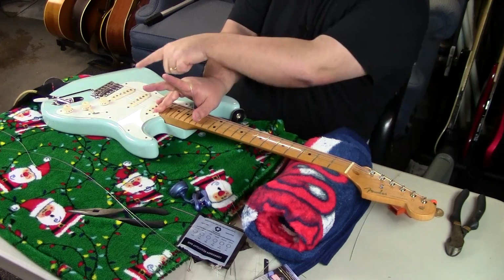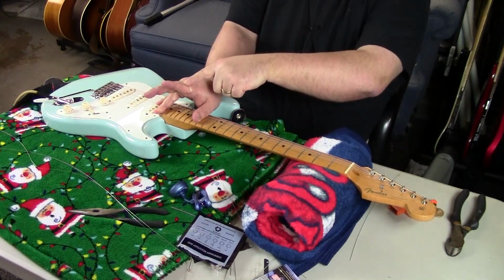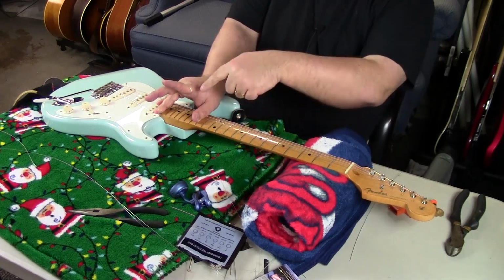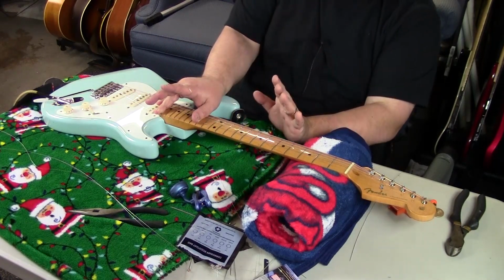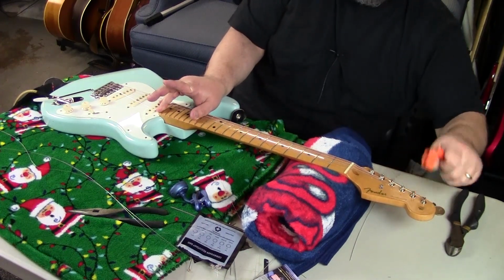And I'm holding this, so it's coming down. I'm holding it down with this finger. It's going up over this finger, which I'm pulling up, right? I'm pulling this finger back and I'm pushing my thumb down and I'm making this very relaxed curve. If you make too sharp a curve, it causes metal fatigue, right? So you don't want that.